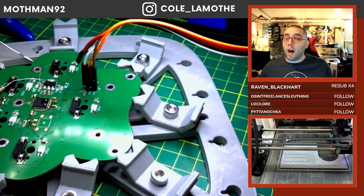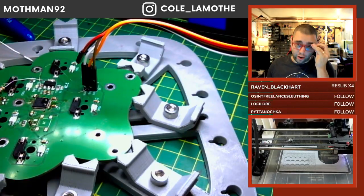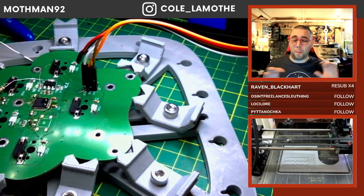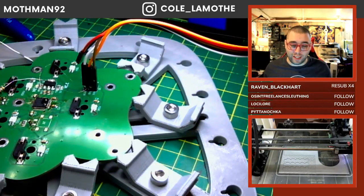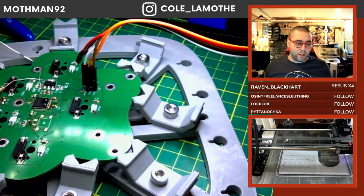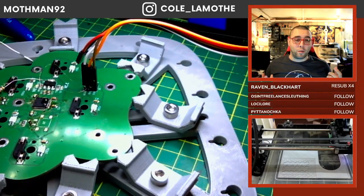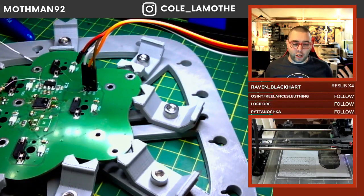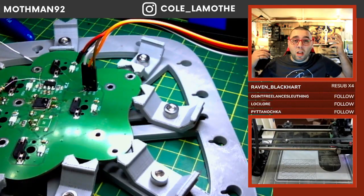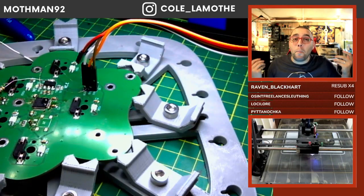Laser is awesome in that way, because it's harder to do with CAD files for 3D printing. Usually you get STLs, which are kind of like a picture of the outside of the model — you have no other information and it's an approximation, a triangular net wrapped around that object. But with laser cutters, you have basically the design files right there — a DXF or SVG, which is already editable. So if there's something that has what you want, that's kind of close, make it happen.